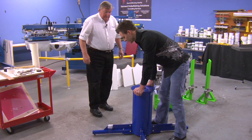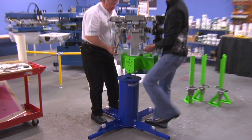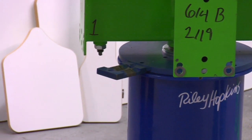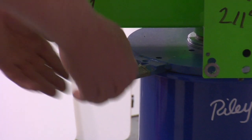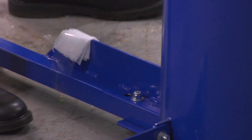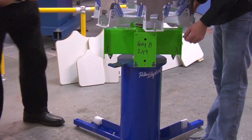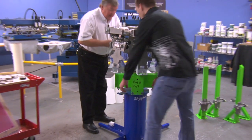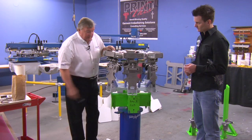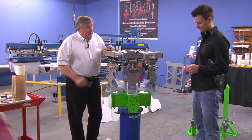You should be able to push on it and not have it tilt back and forth. This is definitely a two-person job to lift this up. This is the registration detent — it basically lines up with the feet. So we're going to pull this over just a little bit to line it up. Let's try putting the four center bolts in first. Kind of look down through here and see the holes underneath. These center bolts are very important but a little difficult to get in, so that's why you want to start those off first.